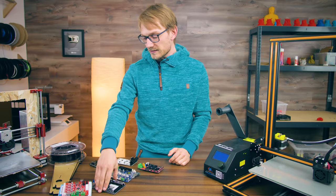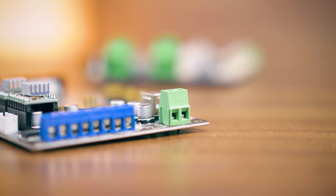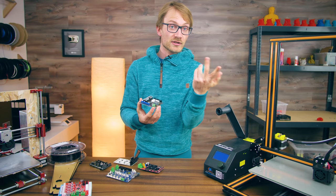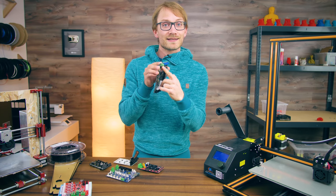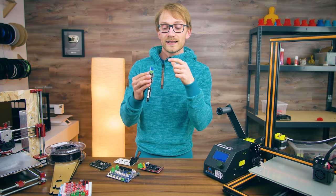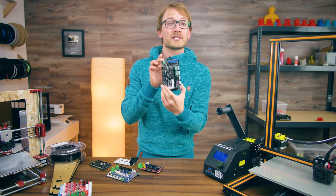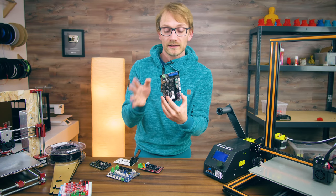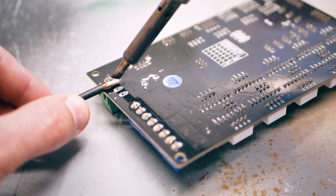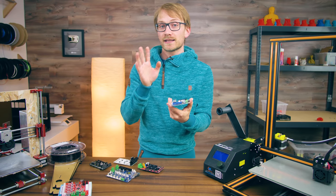What's not decent is this green screw connector on the MKS Gen right here — it even says on its side it is a 10A connector. And you potentially want to push the total current for a 12V heated bed, a 3A heater — two of those actually — stepper drivers, fans, etc., through this single connector, which can all add up to 20–25A, and you're pushing that through a single connector rated for 10A, and that's already the optimistic rating. So in those cases, my general recommendation is just to bypass the connector entirely, solder some decent gauge wires directly to the bottom of the PCB, and just don't use the connector if you can avoid it — any connector is just another potential point of failure.